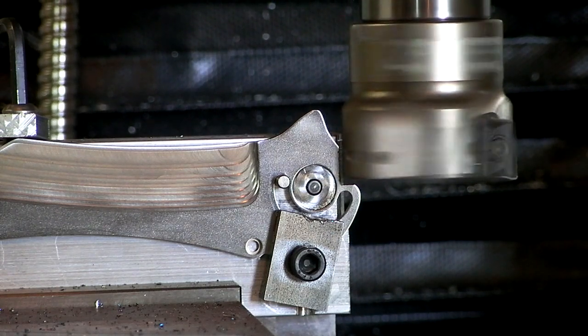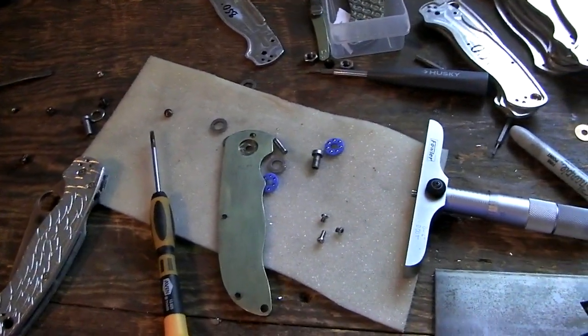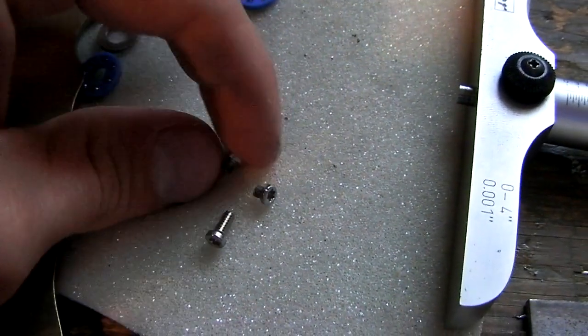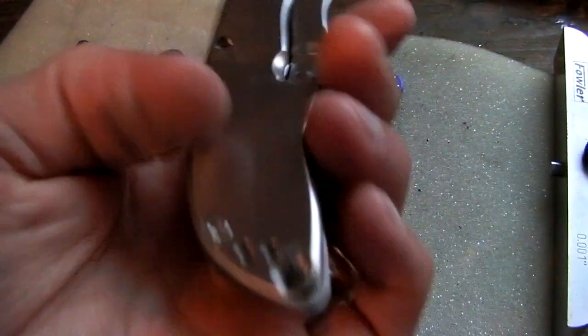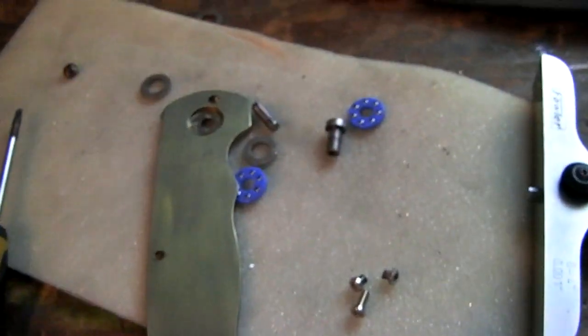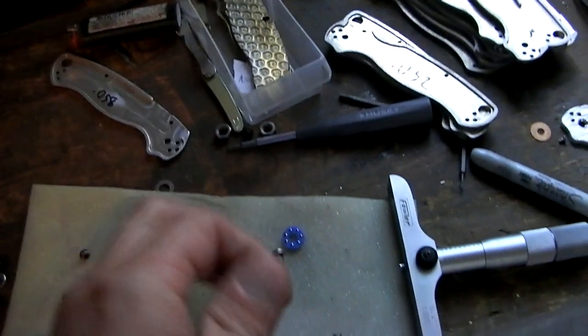All right. The next thing that I have to do is shorten a whole bunch of screws. These are the screws I'm using for the knife — they're 4-40 by 1/4 inch long. And these are how short they need to be for both the thumb stud and for the frame screws, because there's a screw on either side screwing into the titanium spacer, so they've got to be super short. To shorten these ones we basically just held them against the grinding wheel until they were pretty short, and then went against the disc sander to get them flat. But it's not very accurate, it takes forever — it's not the good way to do it.